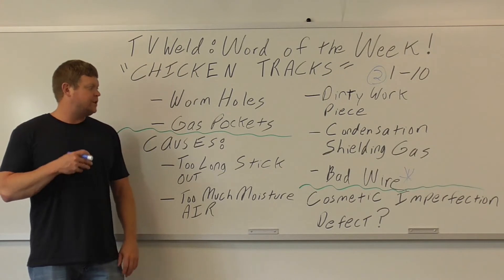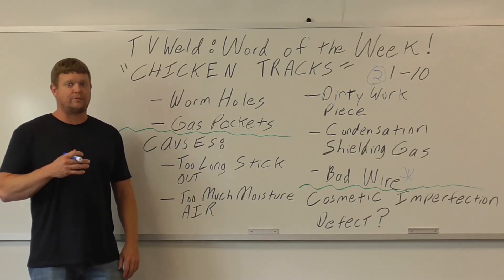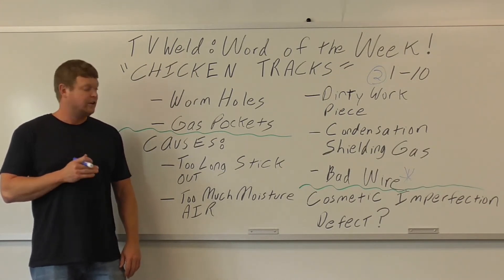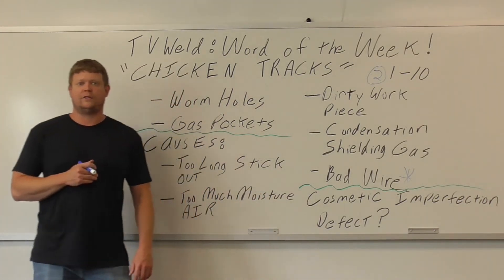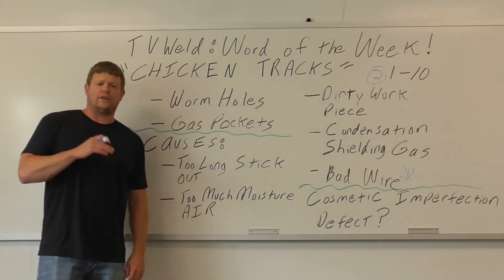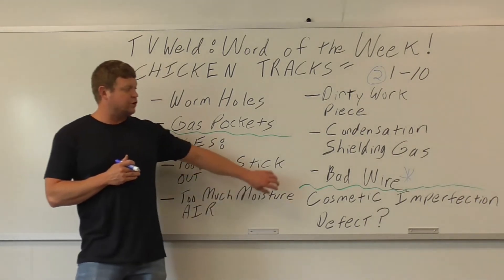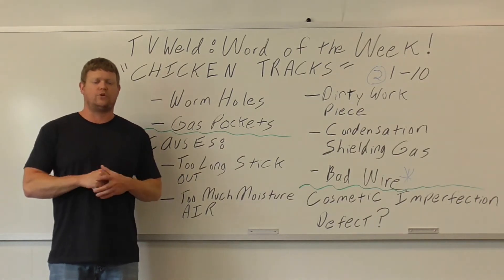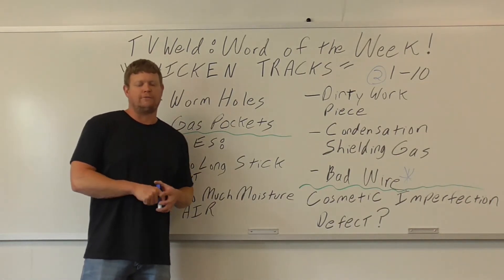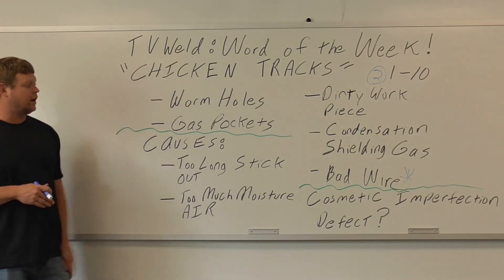They also make a felt pad — kind of like a Scotch-Brite pad — that you put on the wire as it comes off the roll going into the drive rollers. It cleans the outside of the wire as it feeds. That helps with surface contamination, but if moisture is in the flux itself, you still need to run that wire off. If chicken tracks persist and are really bad, they can exceed porosity limits and become a defect — then throw the wire out. Also, when storing wire, put it in a plastic bag, duct tape it, and keep it in a cool dry spot.